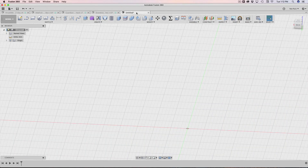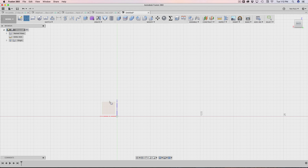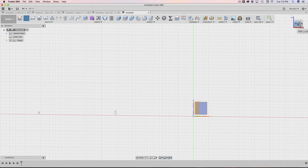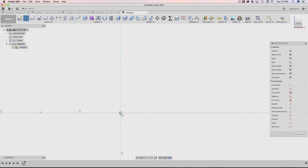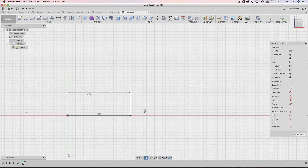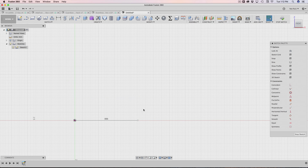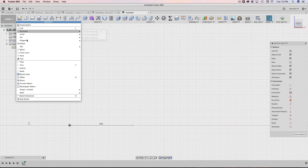So in a new design document, I started by making the path, which is the side view of the skateboard. I'm going to bring up my line tool — I'm in the model workspace, just the regular model workspace. I'll click on the front plane in the view cube and draw out a basic line. You can apply dimensions here if you want, but I'm not going to. I got my straight line, and now I need to make some curved lines — I need to slope down and come up. The best way to do that is to use the spline tool.